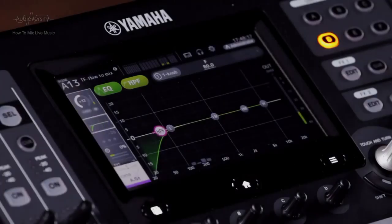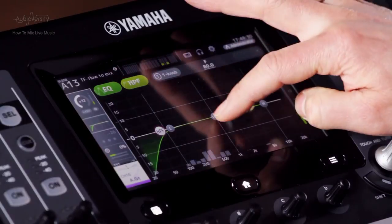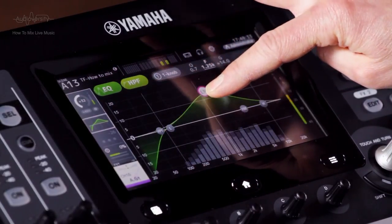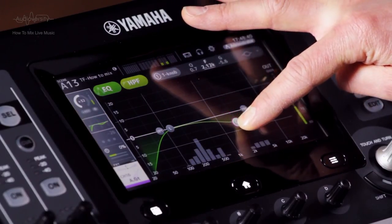It's the mid-bands where we're going to exercise our creativity. First, let's consider the acoustic guitar. This will either have built-in electronics to use with a DI box, or it will need a microphone pointing somewhere between the main hole and the base of the neck. Because of the feedback risk, a mid-band may be needed to reduce the danger frequency. To discover it, greatly increase the mid-band gain and sweep the frequency to find the one which produces the loudest howl or squeal.